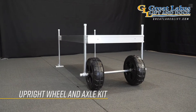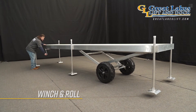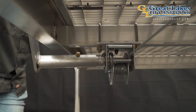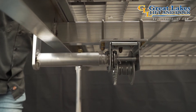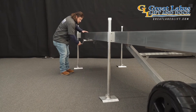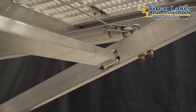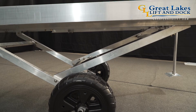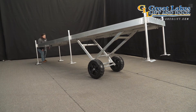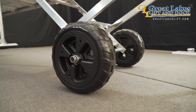The Porto Ease line of docks also has wheel options manufactured by Great Lakes Lift — the Winch and Roll. The main function of the Winch and Roll is to reduce most of the hard work when it comes to installing, removing, transporting, and leveling your dock system. With this hand crank system attached to the Winch and Roll, you're able to raise and lower your dock quickly and easily. When your water level raises or lowers, just give the crank a turn one way or the other until your dock is sitting at the ideal level above water, then adjust the poles on your dock frame and you're done. Winch and Roll systems work on dock spans from 10 foot to 30 foot and provide height adjustments from 30 inches to 72 inches.